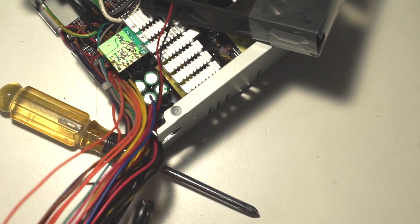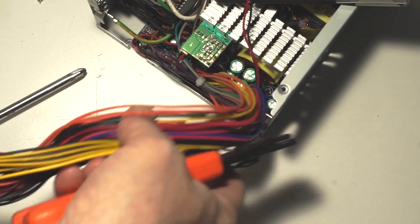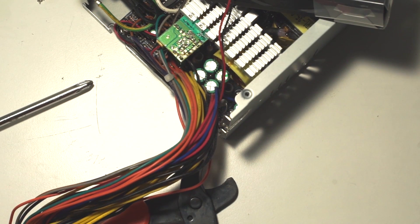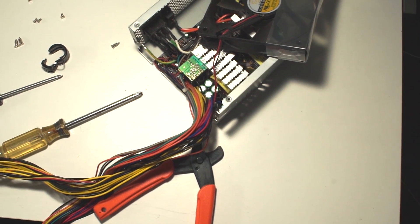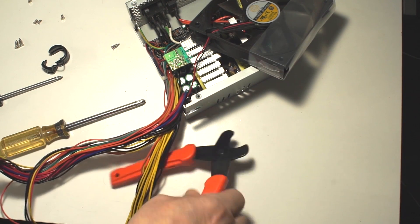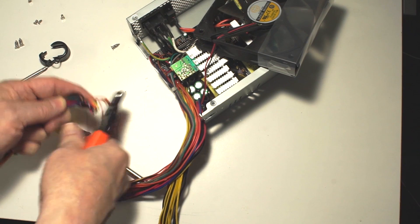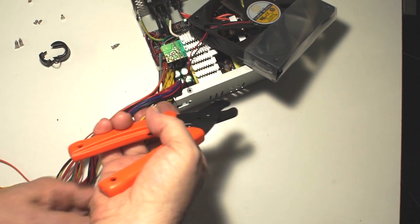There's too much wiring, so best for me just to get a bunch of it out of the way. There are four colors I'm looking for: orange, yellow, red, and black. There's a 3.3V regulated supply — I don't think I have a use for that, so I'm going to ignore it. There's 12 volts regulated and 5 volts regulated and then a ground — those are the ones I'm going for. In looking at the wires, they look like number 20 AWG, which on a good day, short run, is probably good for 4 or 5 amps. So in theory for 23 amps I need maybe 5 wires. I'll increase that a bit because I've found in the past some wires were not what they were spec'd to be.